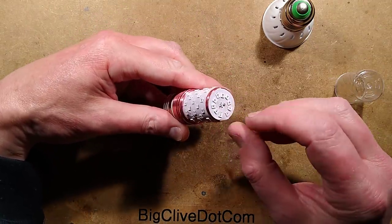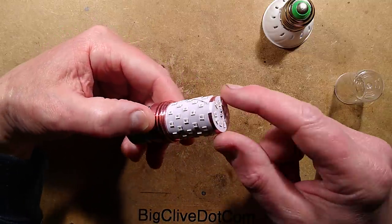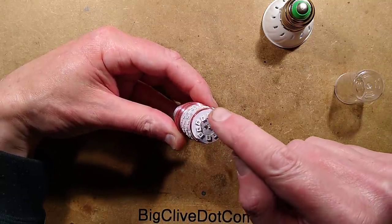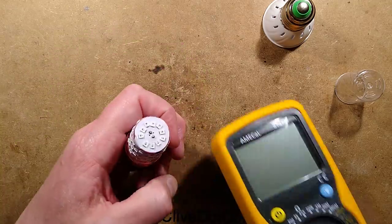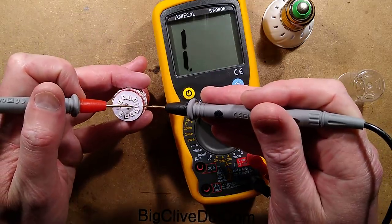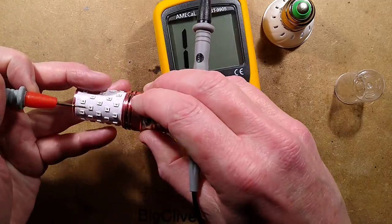This one's construction is quite interesting. It's basically a stick-on circuit board — a thin, flexible circuit board material. They've got a circle with 10 LEDs on it. Let's see how these are wired — let's bring in the meter and see if they're wired in series-parallel arrays. Two LEDs have lit there, let's try it on the side.